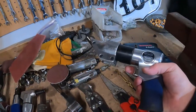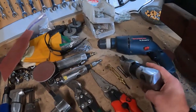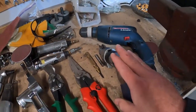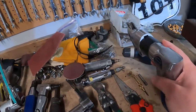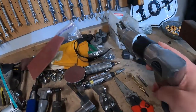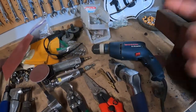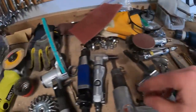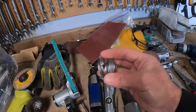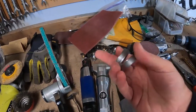For a straight-cut tool, you have a shear — this one is again by Eastwood and works great. It is only really used for straight cuts; you can get it to turn a little bit here and there, but it will not do a 90-degree cut in the middle of a panel. It's not what it's meant for — it's just meant to zip off a rough cut quickly.